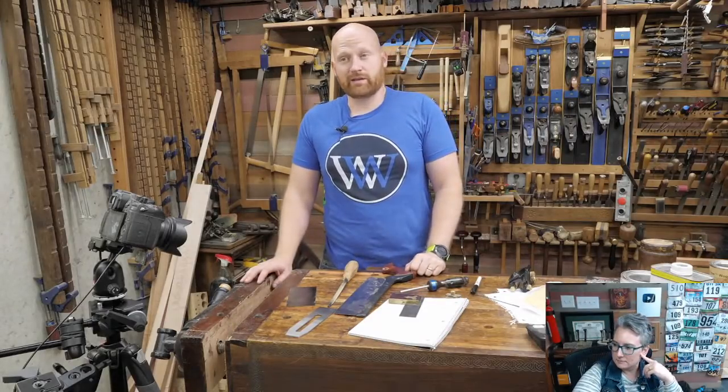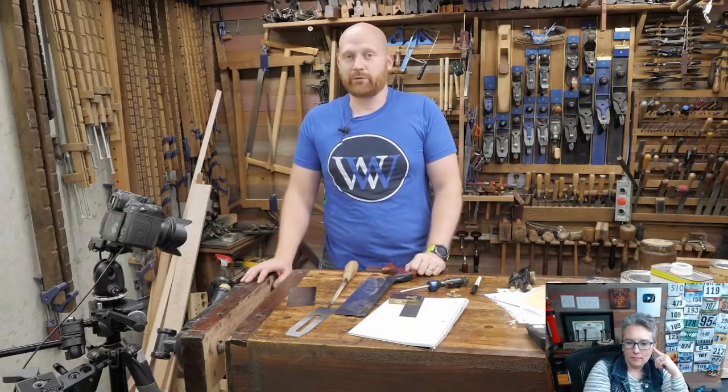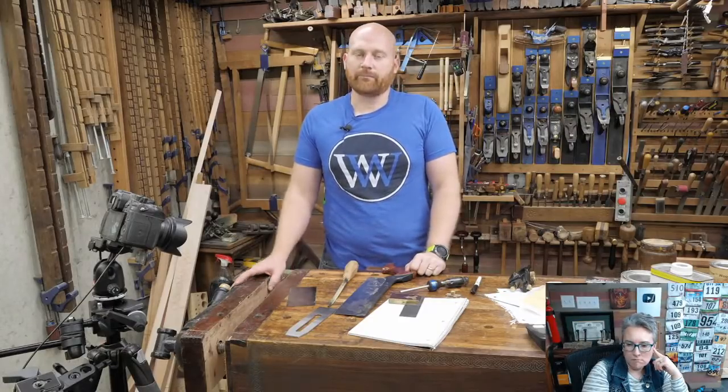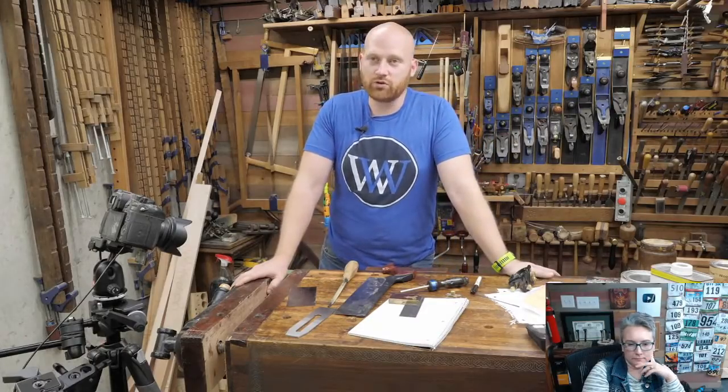It could be that your bevel angle is lower than like 20 degrees. I have seen some people do it down to like 15 degrees. In that case, you look at it funny and it chips. So that could be the case. Another option could be that it is a new chisel.